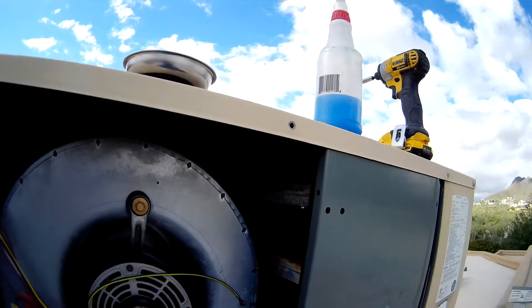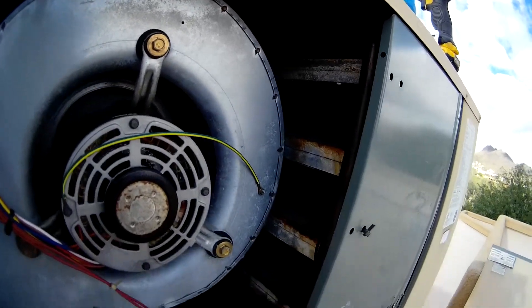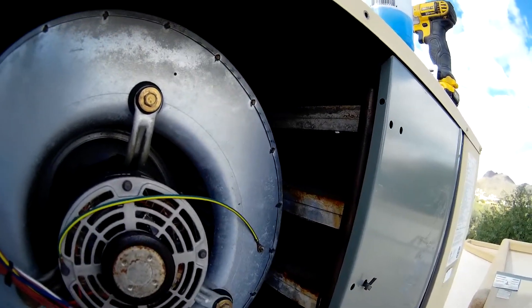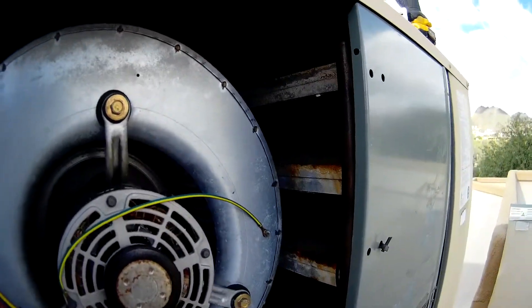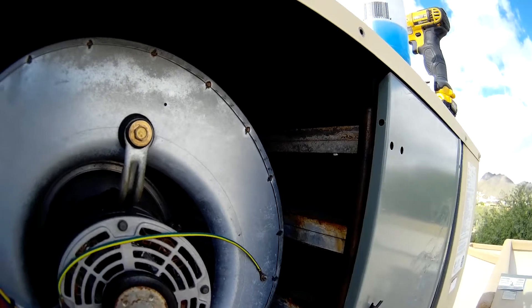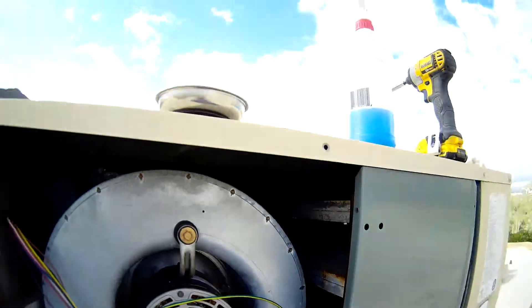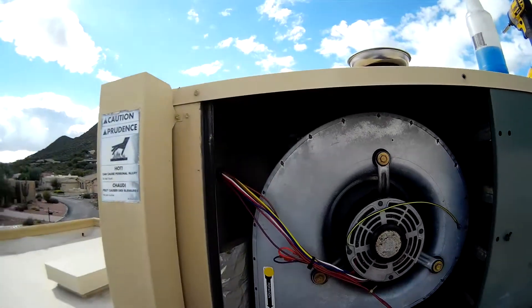Also checking the condition of your coils. As you can see inside this coil here, we have plenty of rust going on. The coil also looks like it's packed with some dirt, which really could be dangerous — if you have a coil packed with dirt and a furnace getting to a high temperature, dirt and heat usually do not mix.